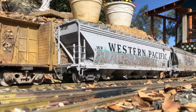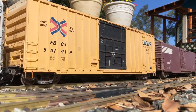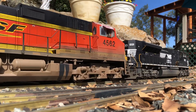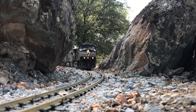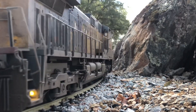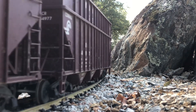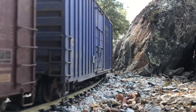Once the train reaches its cruising speed, the manned helpers will actually remain at a speed slightly higher than that of the head-end power so as to control the slack in the train and again prevent string lining, especially on curvy track or lines with steep grades and curves. For example, if the desired cruising speed is at 35% of the remote control power, the head-end locomotives will generally be at 35%, and the rear-end locomotive power may be at anywhere between 38% and 40%, depending on the length and the weight of your train. The operator has to be cautious and actually watch the slack in the couplers in order to keep the train controlled, ensuring safe operation during movements.